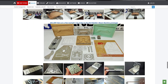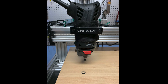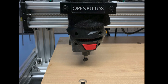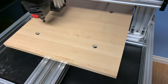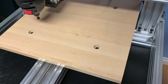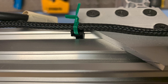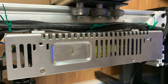Here's a bunch of samples of projects that you can make. When I put it all together, this is basically what it looks like. I chose to use a rotozip router, mainly because it came with three different size collets — from 1/8 to 3/16 to 1/4 inch — for lots of different tools and bits to try out. For the spoil board, I used shelves left over from my Ikea hack where I took two fully functional Ikea shelving units and cut them down into one. They're all the same size and easy to change out when they spoil and need to be replaced. I had my own 24-volt power supply and used the included hardware to mount it on the back side of the X gantry. I 3D printed some mounting clips that fit right into those V-slots and allowed a zip tie to fit through and secure the wiring.